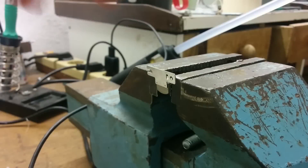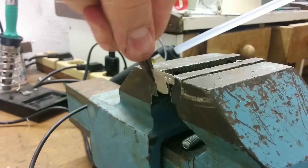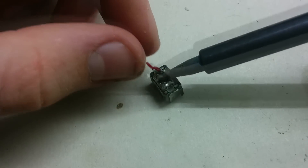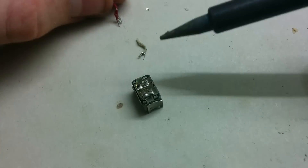This magnetic head has a small piece of metal that we don't need, so take it off with the pliers. Unsolder the leftover wires from the head and find a suitable cable with a minimum of three wires inside.